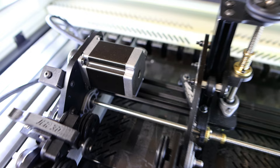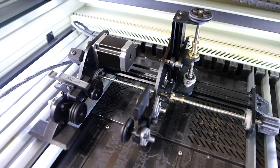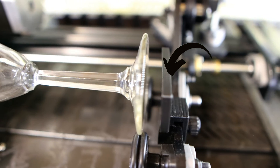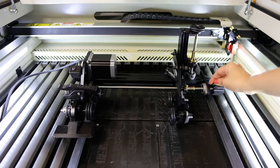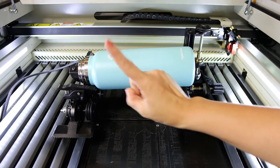The motor is on the inside of the rotary, which is common — it means you'll need to flip your image in your software before sending the job to the laser. The back-end stopper is fixed, so when working with something like a champagne flute or wine glass with a stemmed bottom, you don't have full control over securing that end. Lastly, if you get the Rotoboss low roller like mine, just know you'll be limited on cup length — for example, my mom's 10.5-inch water bottle doesn't fit.